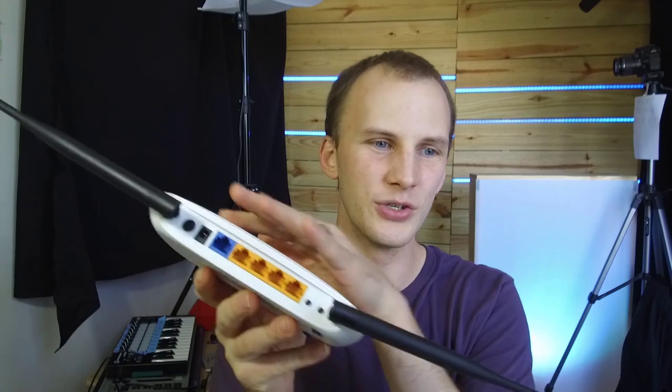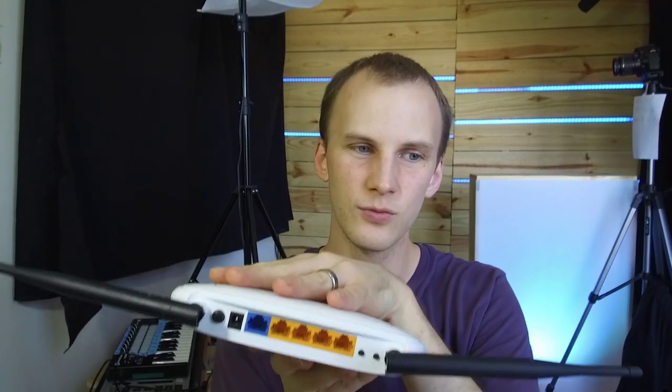We've got one right here capable of running networked DMX and possibly a control signal for controlling the console itself. Coming out of here, the first place we're generally going to go is to a Switch. I've got this household router here, but on show site I don't use this — I usually use just an inexpensive regular Switch. If you buy one with good reviews, you might spend $30 or $50 and it's going to work until you start pumping a lot of DMX universes down.